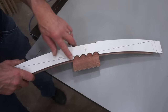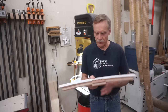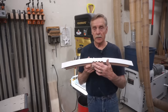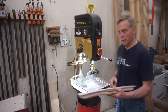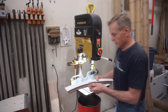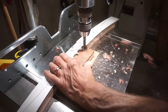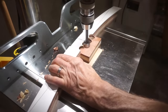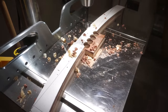And now for the second part of the answer to your question. And the honest answer is that I've kind of got a lazy streak, and I could just rough trim the workpiece near these arcs and then use the router bit, the flush trim bit, to cut those four little notches. But the lazy man's way is to rely on the drill press with the 1 inch Forstner bit chucked up there that I used for cutting these notches in the first place. And using the template as a guide, I'm essentially flush trimming the workpiece to the pattern using a Forstner bit instead of a flush trim router bit. But with the delicate points left between the arcs, this is a more reliable and certain way of getting the job done compared to the risk of chipping those little points off with a flush trim router bit.